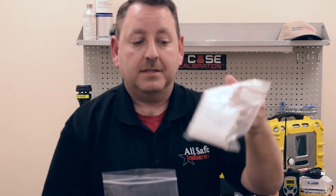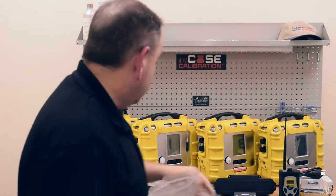When you take that apart, you'll have a lamp cleaning kit for manually cleaning the lamp. Ray Systems added a self-cleaning feature to the PID — when the meter is off and on charge, the lamp illuminates, creating ozone gas that provides a scrubbing feature to keep it clean. But if you get into a really sticky gas and have a coating on the lamp, you manually clean it with the isopropanol in this lamp cleaning kit, along with finger cots, Q-tips, and lens tissue.